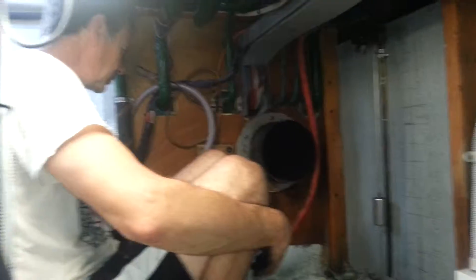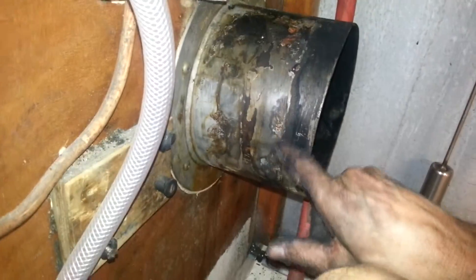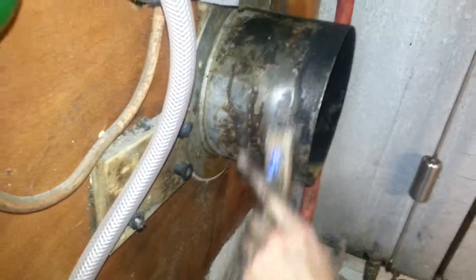What's that piece of pipe like? It's got a little bit of pitting, but it's not as deep — on initial inspection you can see a little bit here, but it's relatively shallow. That's okay. We'll clean all of that, polish it up, and it'll make it easy to get the new hose on as well. You just use detergent, clean it all up and get all this stuff off. When it's smooth, cover it with detergent and the new hose just slides on relatively easily.